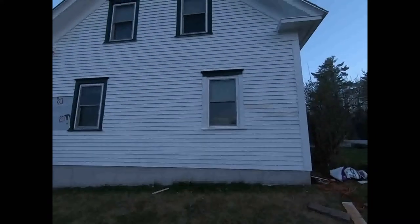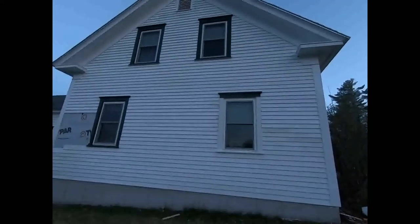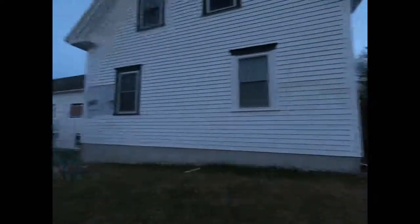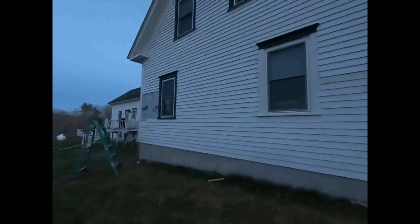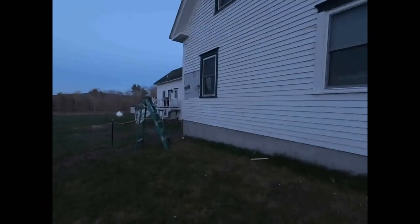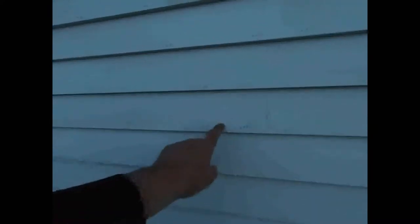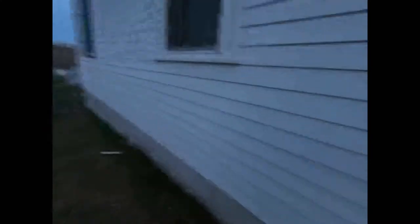This right here is the end of the house that I've been repairing. I still got to paint that window trim green and do a little scraping up there. I got some paint that I took off when I took out the trim boards, and I've still got a little bit over there to finish. I ran out of plain clapboards — I gotta go down in my stockpile and grab four or five, plane them tomorrow morning, put some stain on the front and back, and put them up. I've put my second coat on — you can see the nails and stuff. This here was something that I primed last winter in the shop.